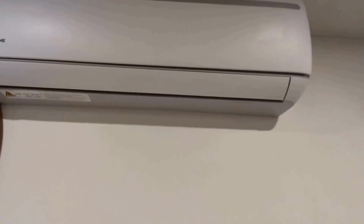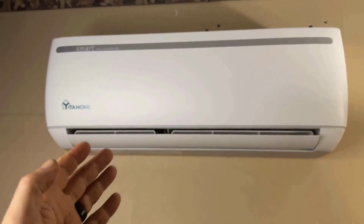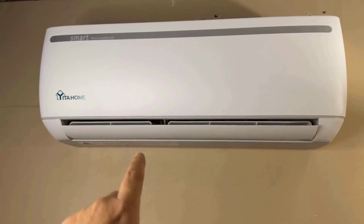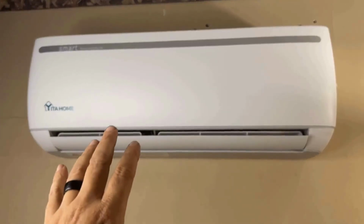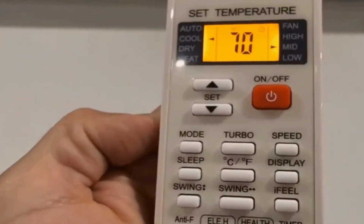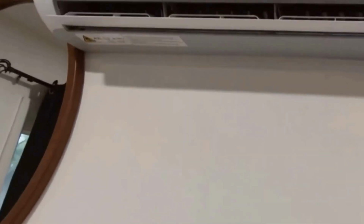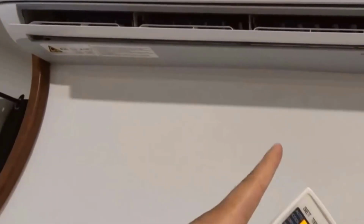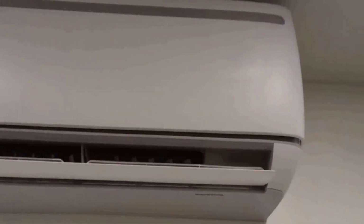That's a big deal for a ductless install, because hunting for matching parts is where a lot of people get stuck. I did notice some small omissions that seasoned buyers might expect, like a wall remote holder, rubber pads for the condenser feet, and protective side caps for the gas connections. None of these are deal breakers, but I had to source them myself. I also found one missing screw on the outdoor terminal block. I replaced it from my parts bin and moved on. Not a showstopper, but it points to quality control that isn't as tight as premium brands.